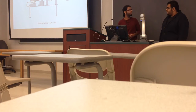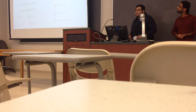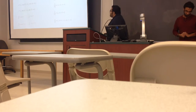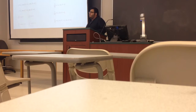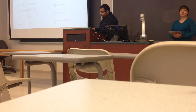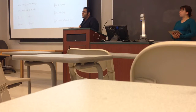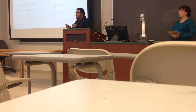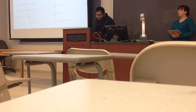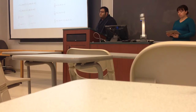Now my teammate Ali will talk to you about the uncertainty analysis. I will talk about uncertainty analysis. We use a Taylor series expansion to calculate our uncertainty for both x and y direction. This gave us the uncertainty for each component from the 4 inputs, which are L1, the length of the first arm, L2, the length of the second arm, theta 1, the angle between the first arm and the x-axis, and theta 2, the angle between the second arm and the first arm. Those are the equations that we use to calculate our uncertainty analysis in Microsoft Excel.